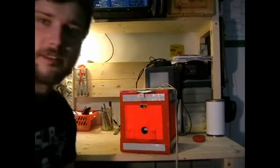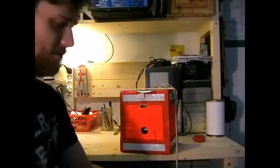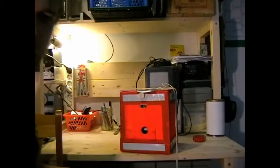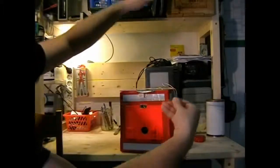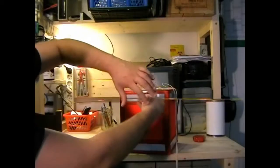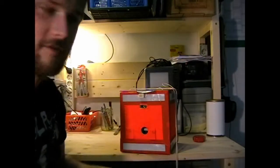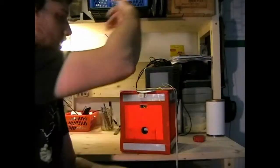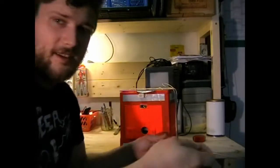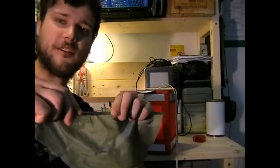For the next start, we plan to do a ground plane antenna at the bottom, because if you see these dipole antennas here, the radiation pattern will be around this way, and we basically lose at least 3/4 of the field, and that's pretty useless if I send out 100 milliwatts and only bring down 25 to Earth. Not much good there. But we wanted to try this anyway, and it just seemed like a good idea at the time.